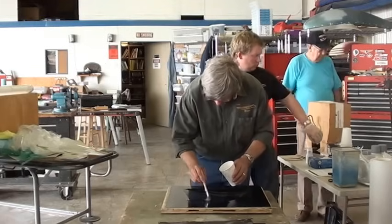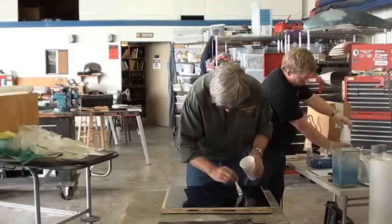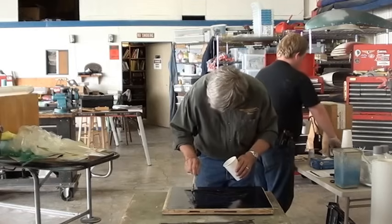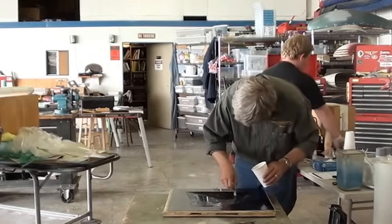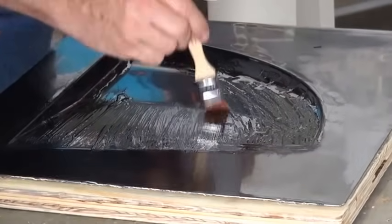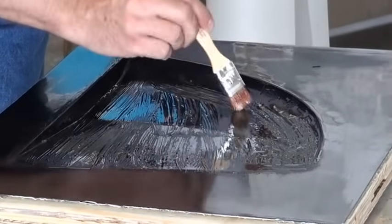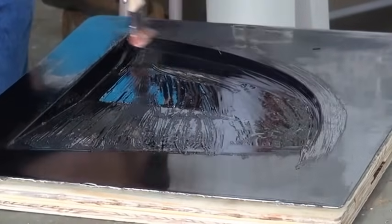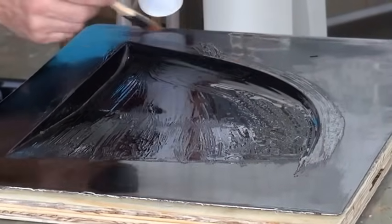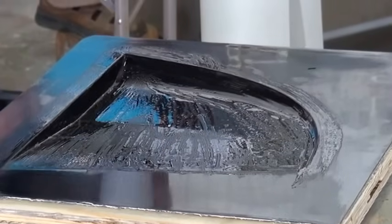We're just going to go ahead and lay up right on top of this wax component right here. And we don't even have to be too careful. We're looking for an even distribution of resin throughout this. And this is easiest to wet out. What's that? For carbon fiber, there's a specific type of resin. There's a lot of resins that will work with carbon fiber. What we're using today, and be real careful about those hairs that I just saw floating around in there. That's no good. Don't want those on the other side.